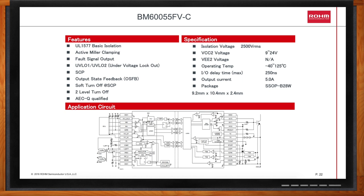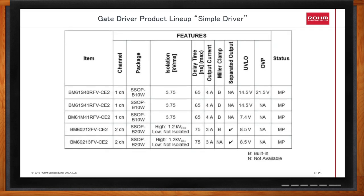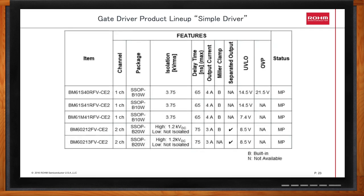Can you explain the differences between the simple drivers? The chart shows the lineup. All of these basically offer one-way communication from the input to the gate driver output. These are available in both non-isolated and isolated 3,750 volt RMS isolation. Some are best suited for IGBT applications and others for driving silicon carbide MOSFETs, differentiated by the under-voltage lockout value. For driving IGBTs, you normally would choose an under-voltage lockout of 10 volts. For MOSFET applications, 14.5 volts is a better choice. For silicon carbide, the BM61S40 is a good choice since it has a window including both under-voltage and over-voltage protection.